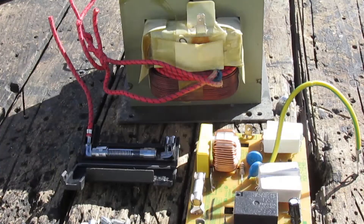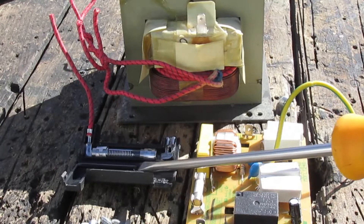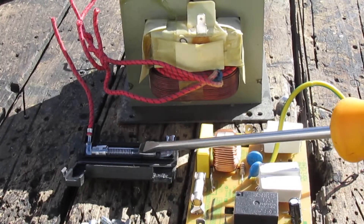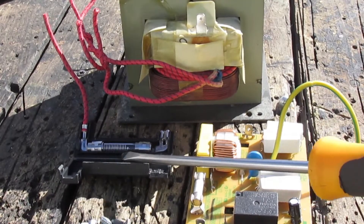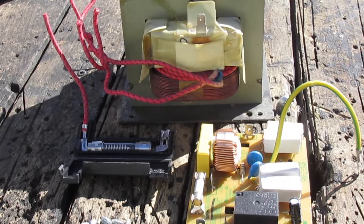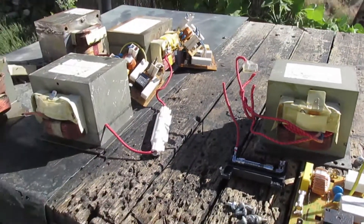After all that cack-handed violence, we've got this little filter board with an 8-amp fuse, we've got a pile of screws, we've got a 650mA 5kV fuse — those are special types with a spring in there for the high voltage — and we've got a microwave oven transformer. So what we do next is put that over there with all the others.